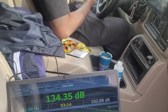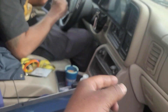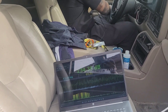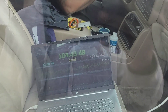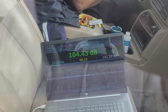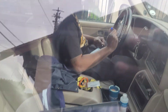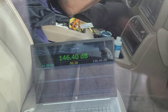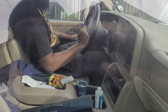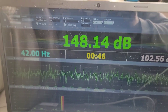Always best to just tap it in because you don't want to scroll your finger too high or too low. Press down and go to volume 40. Keep an eye on the clip indicator. All right, sorry about that — somebody called and interfered with the recording. We found his peak to be somewhere around 42 hertz, so now we're gonna try full tilt at 42 hertz. All right — clip indicator never went red, clean signal. That's the score sealed at 42 hertz.